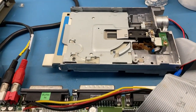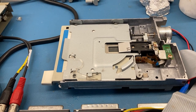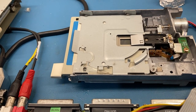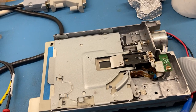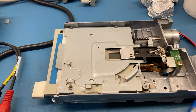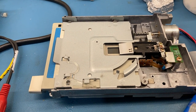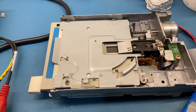it was steadfastly refusing to give me any reading, and the marks in Amiga test kit were coming up with a B, and it was doing that for the whole disk. Rebooting the machine didn't help, and the only thing that did help was taking the disc out and putting the disc back in again. But I don't think it's a head alignment issue, because I've now done several retests on that and it's been fine.